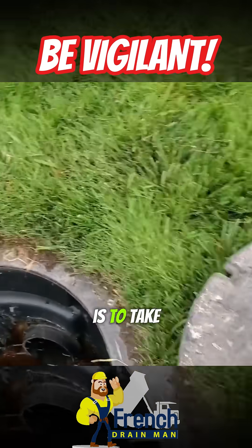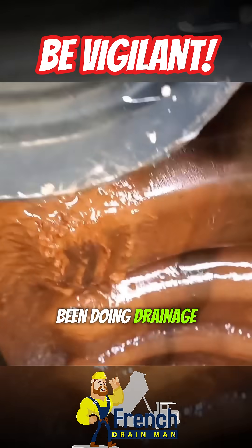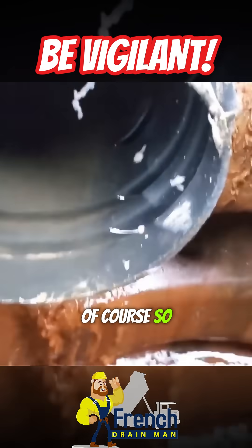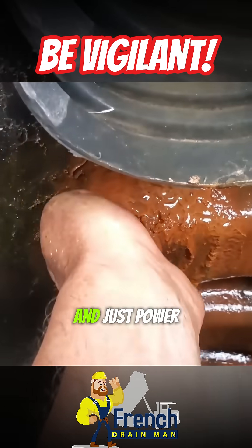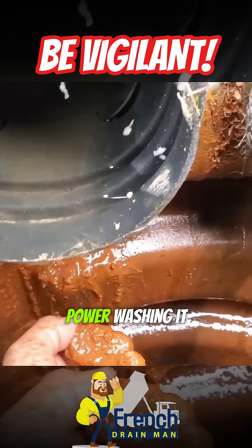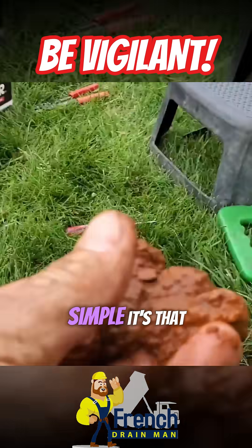The only way you can prevent it is to take one of the ingredients away. In all the years I've been doing drainage, I've found: build them so they don't hold any water. Now our sump systems hold water, so what we recommend in that case is to take a power washer and power wash the iron ochre buildup. With your sump pump in the bottom, as you're power washing and the water level rises, it's just going to turn on and wash it all away. It's that simple.